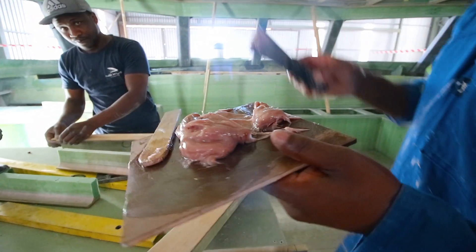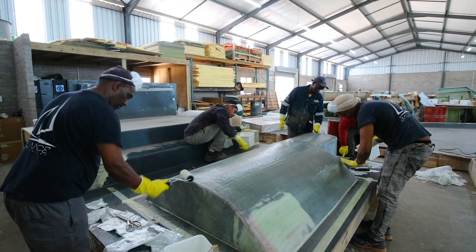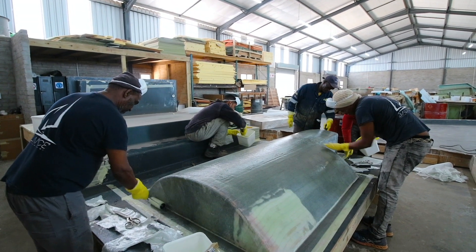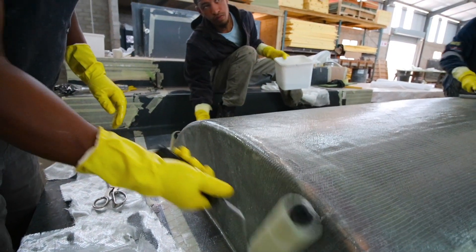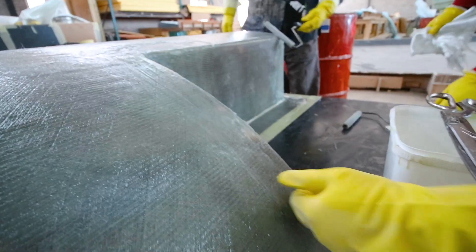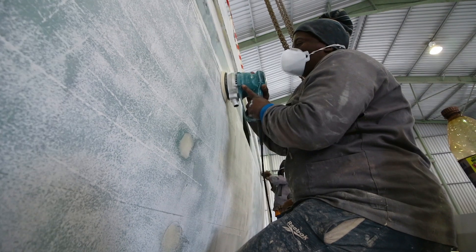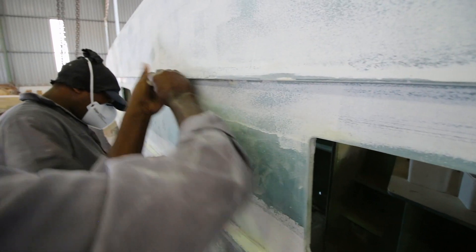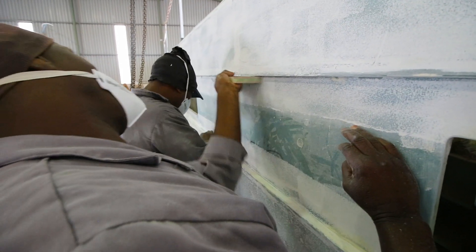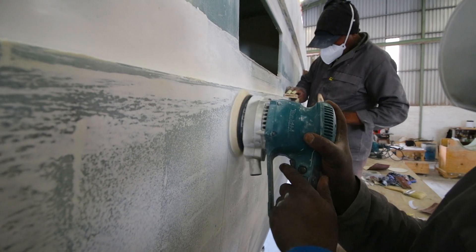On the 526 we use all epoxy resin. The nice thing about epoxy over polyester resin is that it has much superior mechanical properties — higher resistance to wear and moisture, much greater flexural strength, improved bonding strength, and less shrinkage. It's basically 2% shrinkage compared to 8% for polyester.